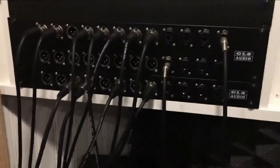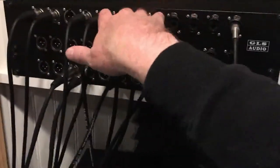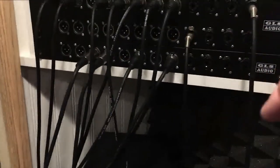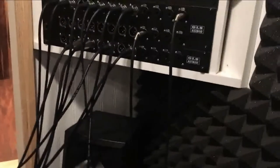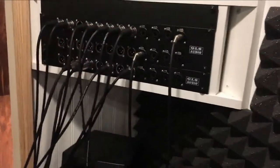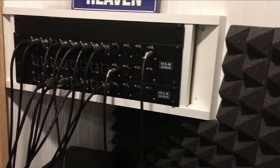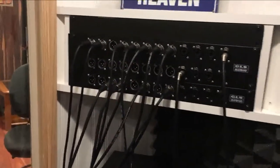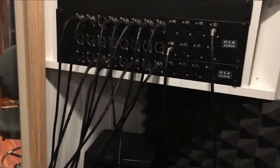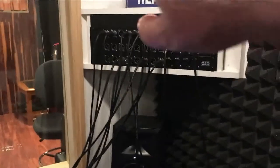These were kind of a hassle to wire up because I had to put the wires into the ports and then use a voltage meter. I connected a battery on the other end to verify that I had the right wires — I'm an amateur at this. I did study audio-video production in college back in the 90s and I've done live sound and recording work for years, but building the studio was not my forte. When it came down to it, labeling each wire individually was something I didn't know I should have done. In afterthought I should have marked them clearly — put a piece of tape around each one so you know this is 1-1, 1-2, 1-3, etc. It'll save you a lot of headache when finalizing the configuration.